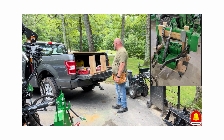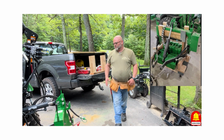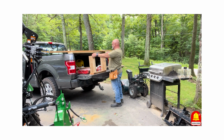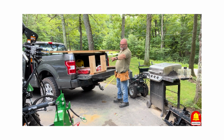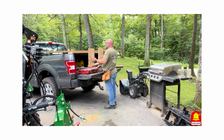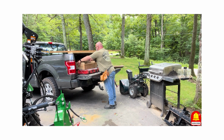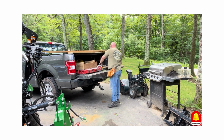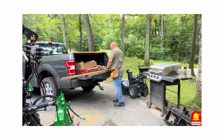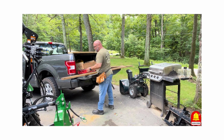So let's cut some 2x4 for the top. Okay, so before I go any farther, I'm going to measure my uprights outside to outside and make sure I got this right. So I'm at 22 inches, which is exactly, if you remember, 22.5 from inside the gusset to inside the gusset. So that's perfect. So I'm going to cut. I think I'm going to do 3 pieces of 2x4, which might be way overdone, but I'll show you why in a minute. Actually, there's only going to be one that's going to be 22, and then I'm going to do 2 a different size.